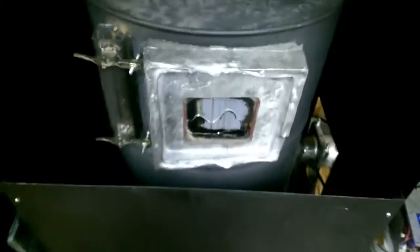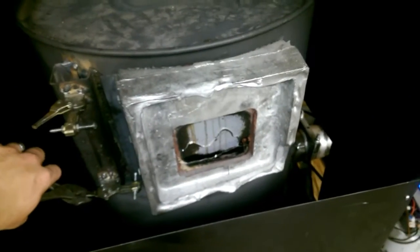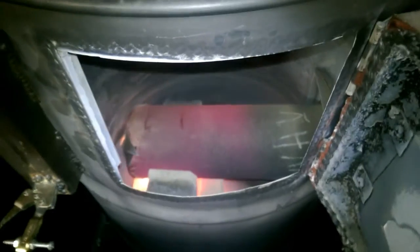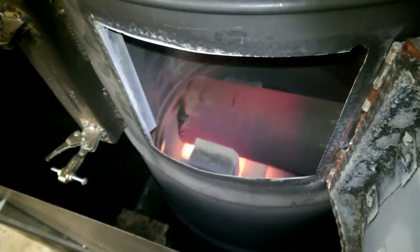From there, the blast tube goes in and goes into my barrel. What I used for a burn chamber was a piece of eight-inch stove cast water pipe. It's not very high-quality stuff, but it is a good cast metal that seems to withstand the heat pretty well. It just vents down the inside of those blocks and blasts the bottom of the barrel, and then the hot gases go up and out the vent on top. With it open there's a little bit of odor, but as you can see there's no smoke coming out — extremely clean burn.